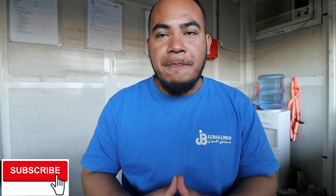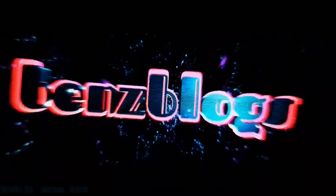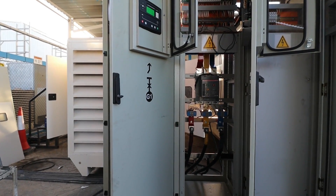Hello guys, welcome to Vince Vlog. Now we have the synchronizing — this is the 1600 amps totalizing. I will show you the connections and how we are going to do the testing. This one is two pieces of 500 kVA, and we will see how we do the manual synchronizing and the automatic synchronizing. So let's go outside so I can show you those connections from the incomers to the generators.